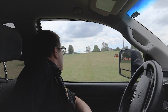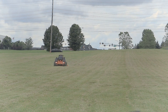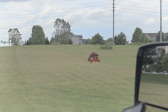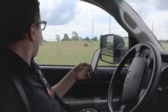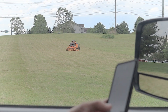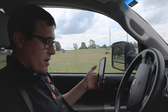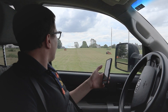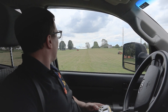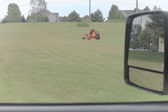This machine here just faulted out on something — let's check that. The camera is detecting something around the front and left side. I can see there's nothing there, so I'm going to have it go ahead and proceed. I think it's going to try to go around it, whatever was there. Oh, there's a hole — that's what it was. I'm going to go ahead and turn the machine off, turn the blades off, go into remote control mode, and drive around the hole. We're getting out of the hole. If I re-initiate it's probably going to fall back in the hole, but let's go ahead and try.